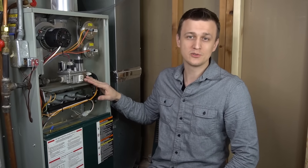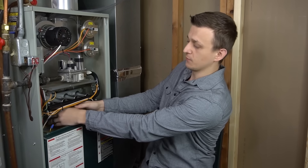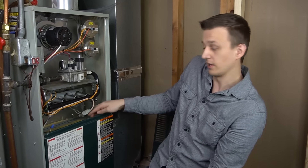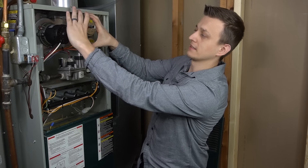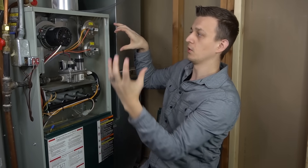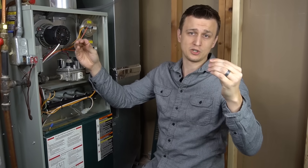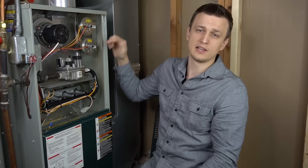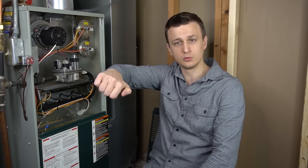So that is how to manually light a furnace. Now, not all furnaces will be nearly as friendly as mine — I have a lot of room under my burners to work with and I could actually stick a lighter in there. Many furnaces will not give you that room, especially if you have a high efficiency furnace where the burner box is up top with a door or cover over it. You're going to have to take all the screws out, take the door off, and the burners are not going to be nearly as accessible. In that case you're going to need a match on a stick or a long shaft lighter.